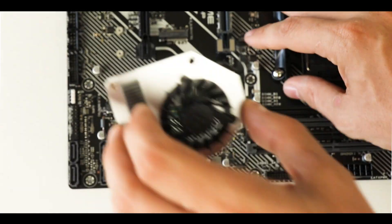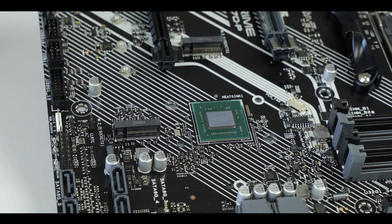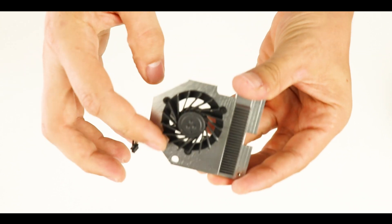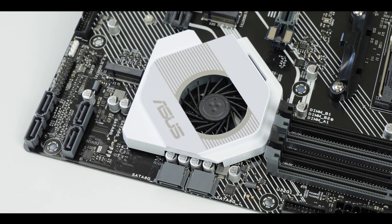A little word on our chipset: the X570 chipset needs up to an unprecedented 11 watts of electricity, which is twice that of its predecessors, producing a lot of heat. That is why X570 motherboards now come equipped with a blade blower, which despite keeping the chipset very cool, did not make much noise — especially if you keep it behind tempered glass. For storage, the board supports up to six SATA 3.0 plugs, meaning six gigabits of data transfer on each plug, which is not a lot, and I would like to see SATA 3.0 replaced by something with more bandwidth.